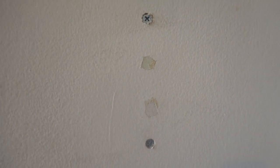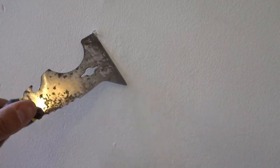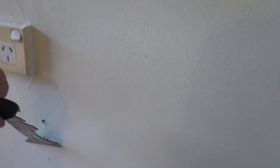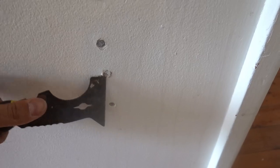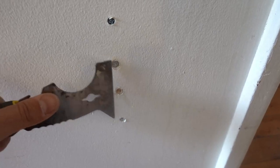In some areas you'll find it's now nice and flush but the nail head isn't exposed. In that case, take a nail punch and tap these nails back into position so they're nice and secure, then patch over the top. Go through all of them — if they need to come out or if you can take them out, take them out. If not, scrape them down nice and flush, tap them down with the nail punch, and make sure they're all nice and secure. Where we've got two exposed here, use the edge of your multi-tool and pop them out.